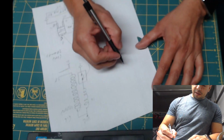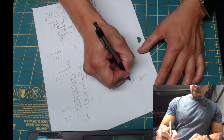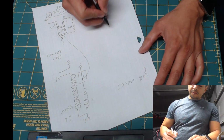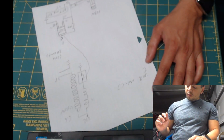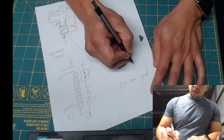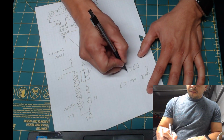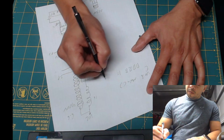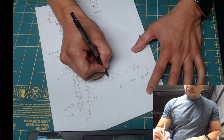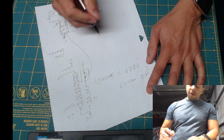So what we do is, this is your main function. And in here, we are going to specify that pin B is going to be an output pin. So we go to the register for port B, which is DDRB, and we're going to specify that DDB3 is going to be an output.